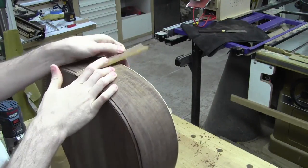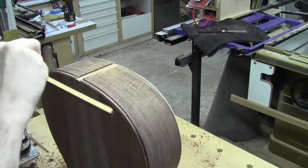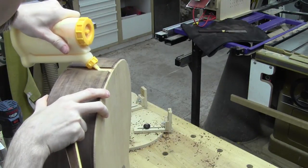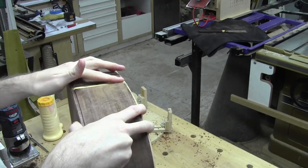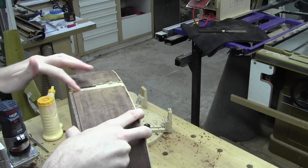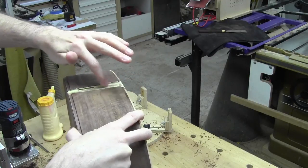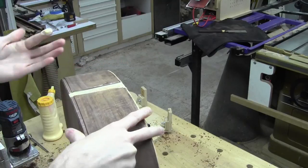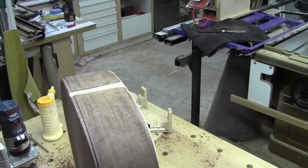So we'll just pop it out, apply a little glue after you clean your nozzle. Put in a bit of the glue, and I'm going to make my finger all messy. I'm going to get some up onto these side walls here and down into those corners. Oops. Making a mess up on the top surface is not necessary. Fill those areas, that's a lot of glue actually. That's plenty of glue. I will get lots of squeeze out. This is going to make some squeeze out for sure.